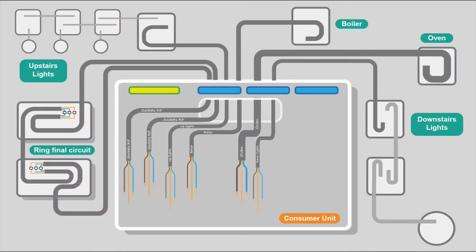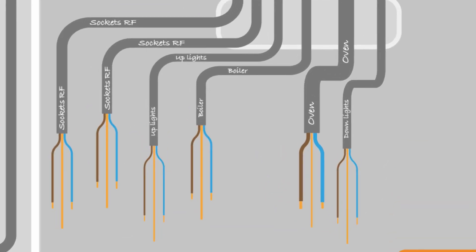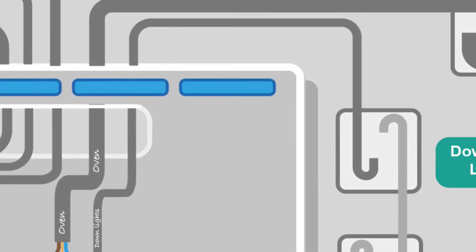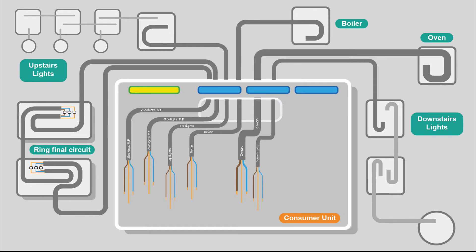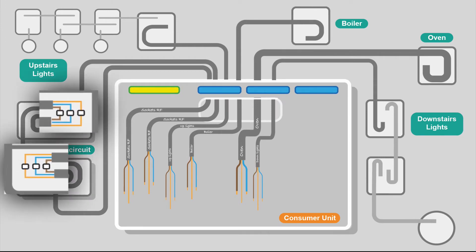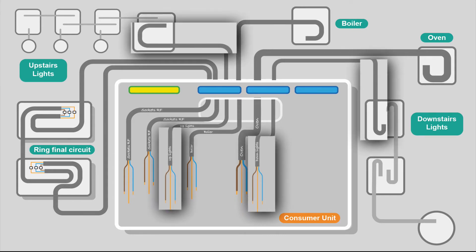Once your first fix is done and cables are in, this is a good time to test — the board hasn't been populated yet, we've just got the cable into the case of the board. We've got all cables run from the fuse board to various outlets: a couple of lighting circuits, an oven, a boiler circuit, and a socket circuit. In the consumer unit, the cable ends are taped back in the back boxes; check the cables aren't squashed. We can test the ring final circuits at the fuse board as long as we link them out, and we can test radials like the boiler and oven from the consumer unit.